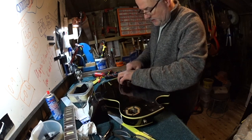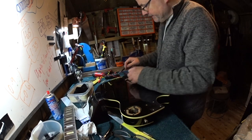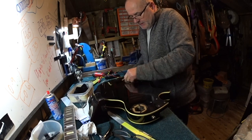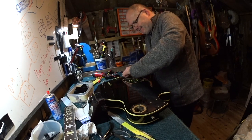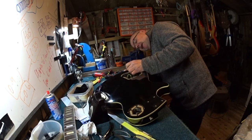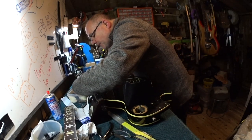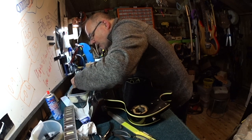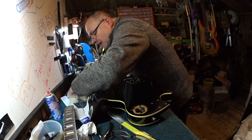This goes round this pot, which it doesn't need to do. These lugs, just in case, sometimes they end up touching the wood, which is what you don't want. I don't know why, but sometimes the finish on the wood can actually cause a short, or a partial short. Technically it shouldn't, but I have seen it where it does. So let's put 2 of these back in.